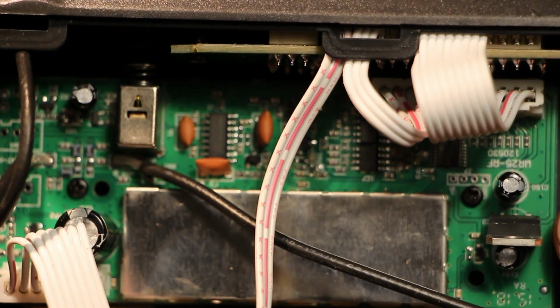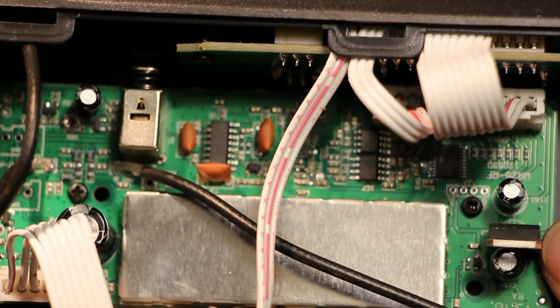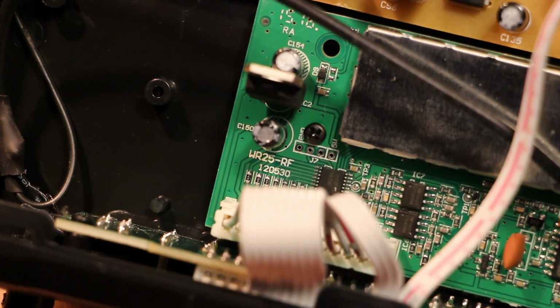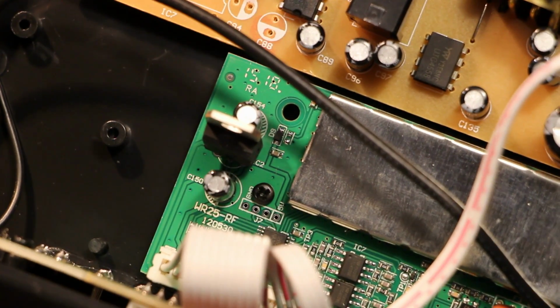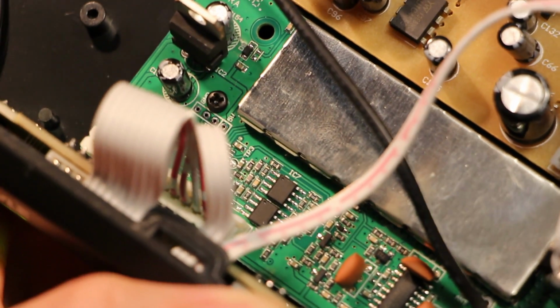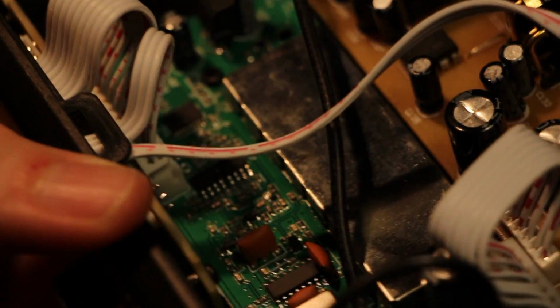And this top board, I'm guessing, either is something that the same manufacturer might have invested a little bit more time and money into designing, or it might be a module that they buy from someone else. The model number on this board has the same format as the other board, even though they use very different manufacturing processes. So that would seem to support the theory that this isn't a subcontracted module, but it's just something that they care more about, or needed the extra density in.